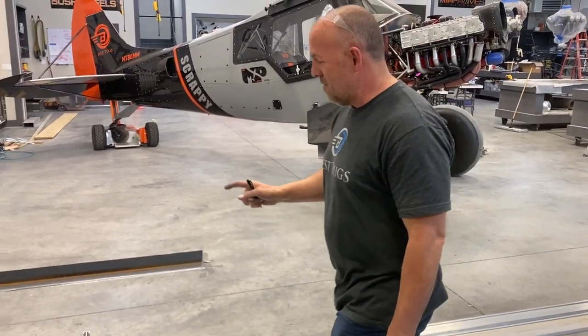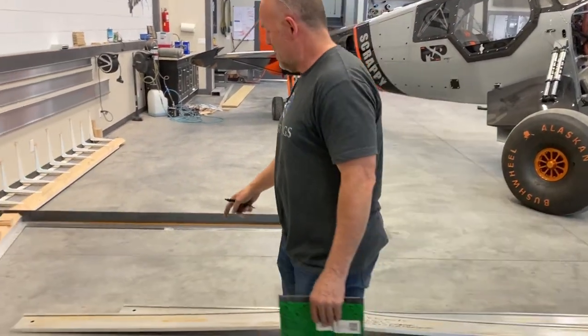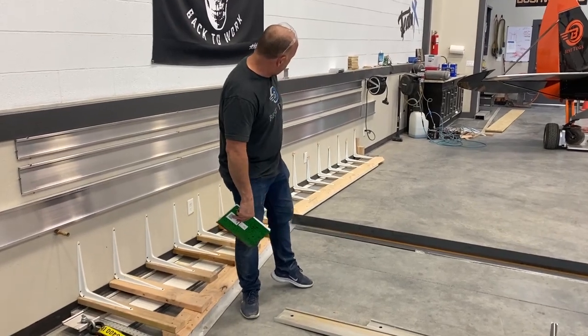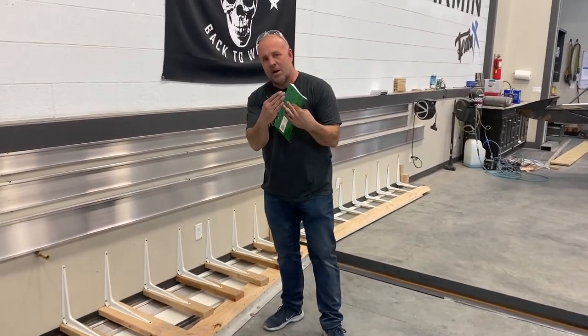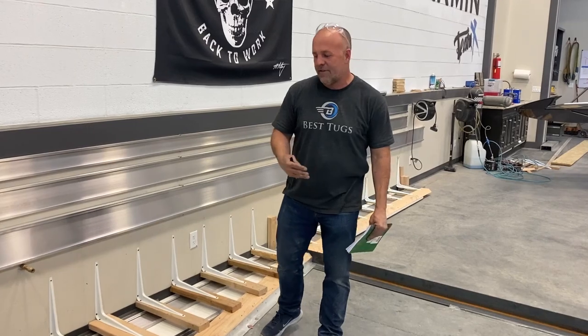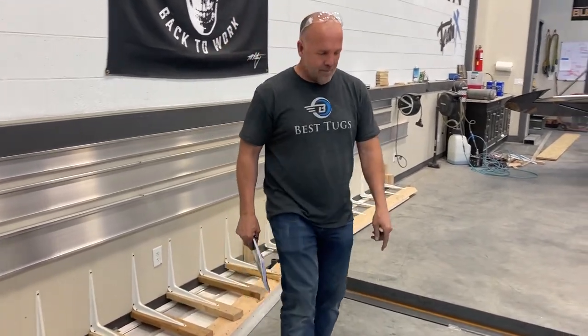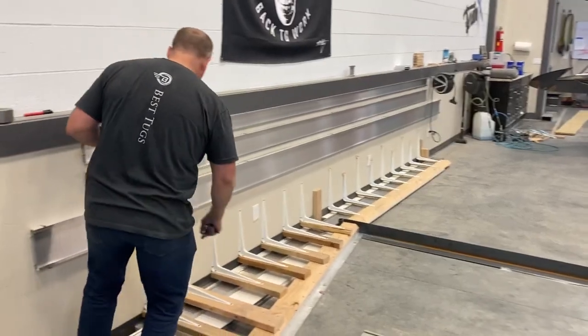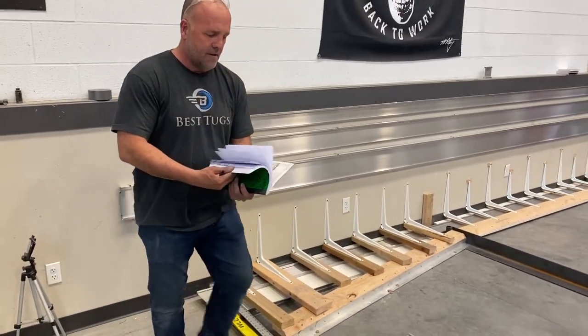All right, we're gonna redo the front spar of a Cub with the rest of the rib simulation bolted to the wall. So we've got the ribs tightened up from 22 inch spacing to 11 inch spacing to see if we can get a better result than this one when it blew out the sides. I'm gonna go ahead and get my starting measurement, 8.5. Let's pull it.